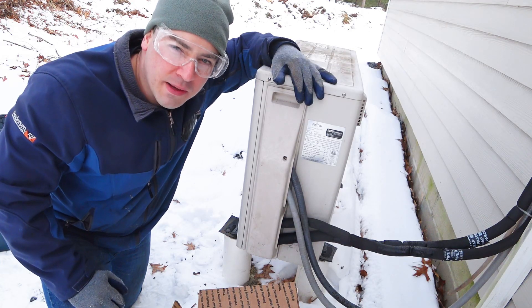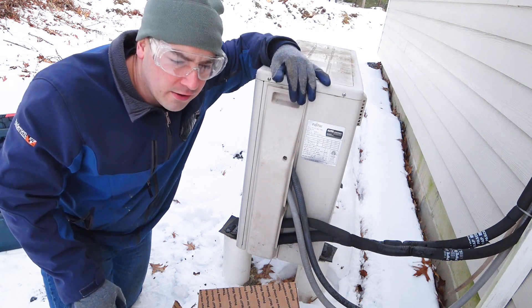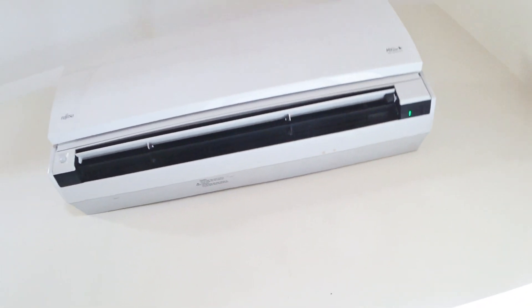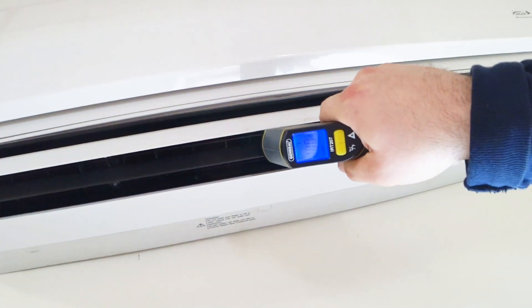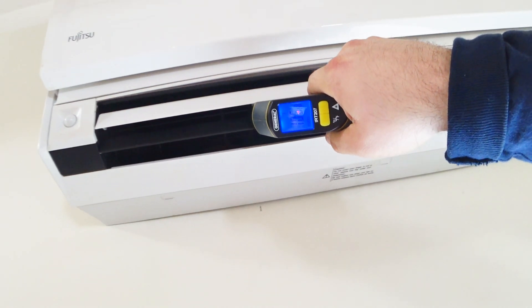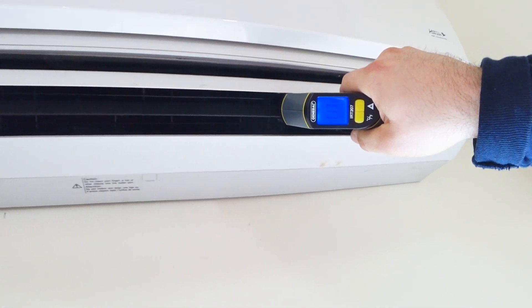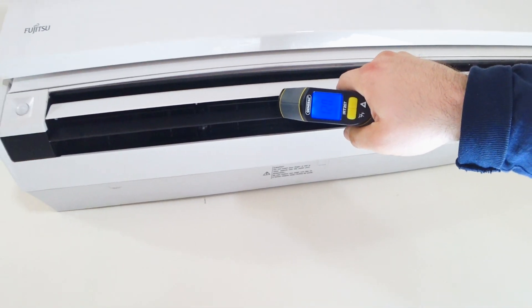We got up to about 110 PSI, so I'm going to let it sit for another hour and then turn it on in heating mode and see if we get any hot air. It's showing a red light — not sure what's up with that. The unit's turning on and I set the remote to 78 degrees in heating mode. This thing is blowing — still going up. It says 109 degrees, 112. So it is heating right now. I guess that's how you can make a repair on a unit, and for $140 I might get another six months out of it.